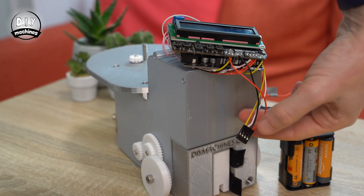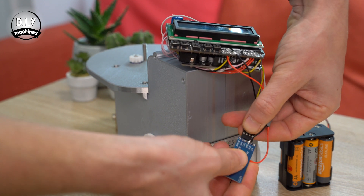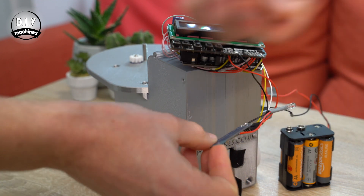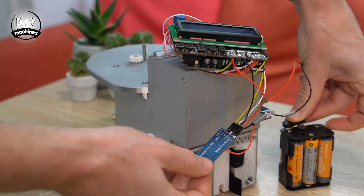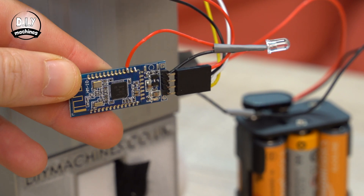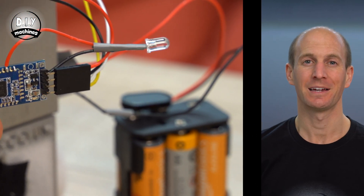We can now connect the module to the wires which we soldered to the display's terminals. Ensure that the orientation of the connector is such that the pin marked VCC on the module is connected to the 3.3 volt wire. The LED should start to blink when you connect the batteries to your project. If the onboard LED is blinking but yours is not, then you should check your connections, as well as checking you have the LED oriented the right way round.